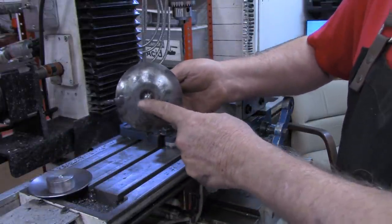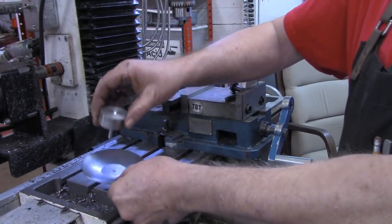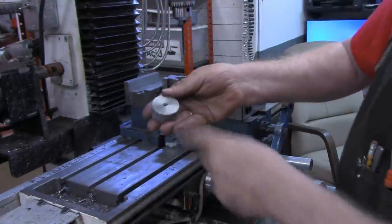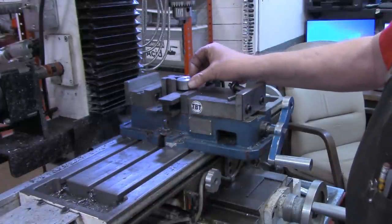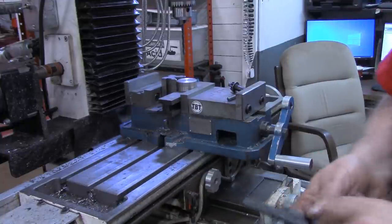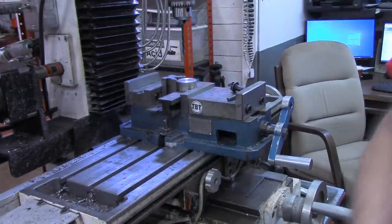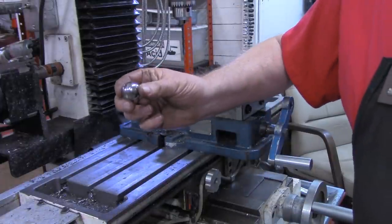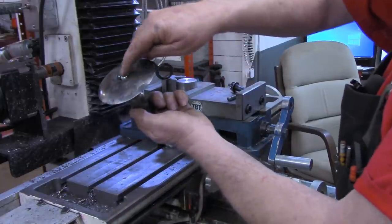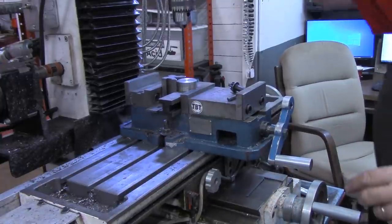We've got the flat surface we made with our mold and die, but we need an indention in the center for the screw head. So I'm going to take this same die that we made, take the screw out, turn it over to the bottom side, put it here in the mill, and I'm going to use a seven-eighths bit and put just a little countersink in there. What that countersink will be is for a steel ball to push down in just enough to form this indention. So let's get this centered up.